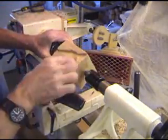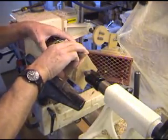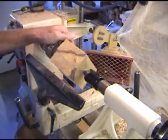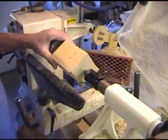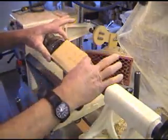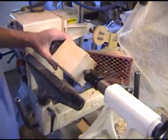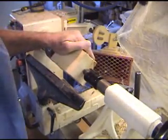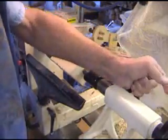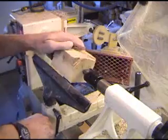I go in and I look at my wood, comparing here to here, looking for center. Kind of crank it in there just a little bit, and then move each end to where it looks like I'm centered both directions. And once I get to that, we tighten the tailstock down and lock it in place. Bring our tool rest up, make sure we're clearing.